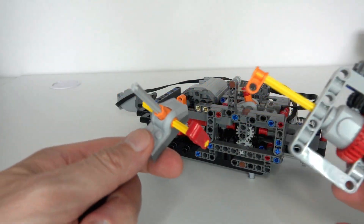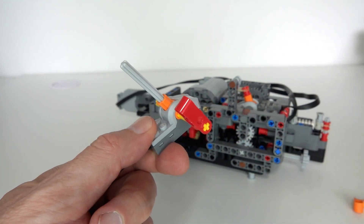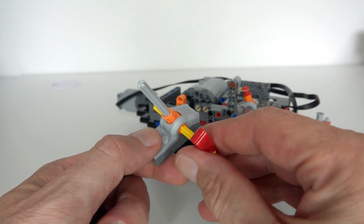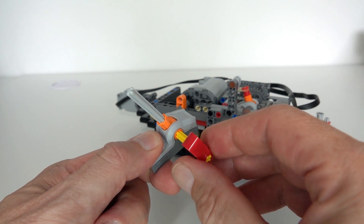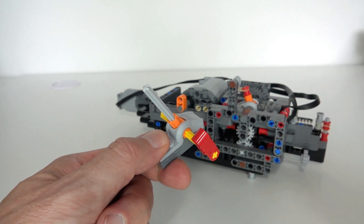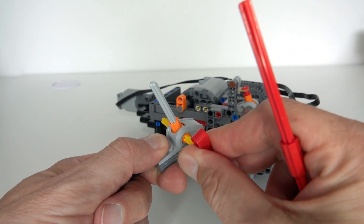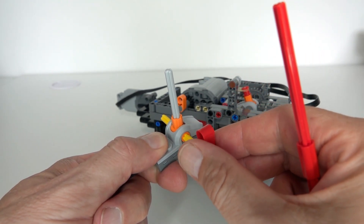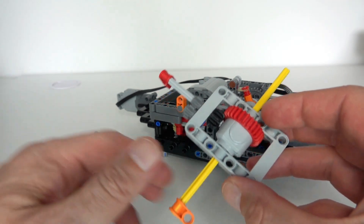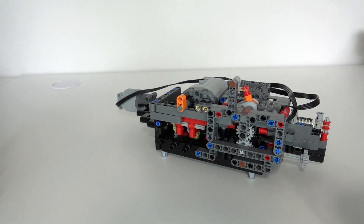The output from the torque detector drives that electrical switch. This switch has three positions and you can drive an axle through the middle to rotate it. The output of the torque detector drives that switch through a number of gears to reduce the rotation angle needed, since the switch is relatively sensitive. One issue I had to overcome was that the switch is very sensitive - the moment it rotates just slightly from fully left, it switches off, and past center it goes all the way to reverse. I didn't want any small rotation from the torque detector to immediately trigger a gear switch.